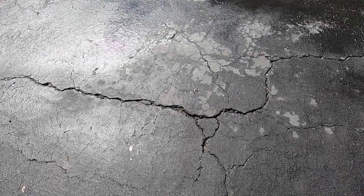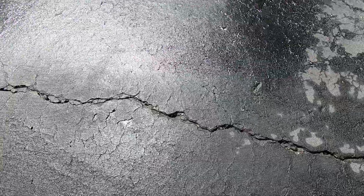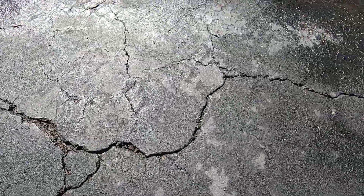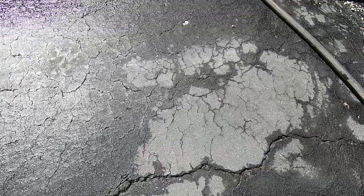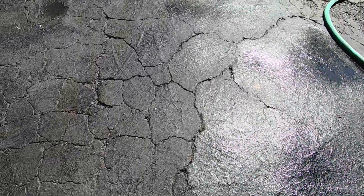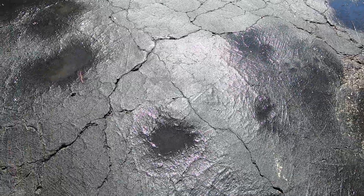Got all the power washing done. We're looking at some of the larger cracks — these are the ones that usually need special filler or where I usually mix in extra sand. You definitely want to seal them first and then wait a day and do your main driveway sealing. For the finer alligator cracks, a regular coat of sealer will usually take care of them. Tomorrow morning we'll sweep out any remaining puddles and get it dried off. It's always easiest to seal early in the morning when it's cool and the asphalt is still cool — that way it doesn't dry as fast and it tends to spread better.